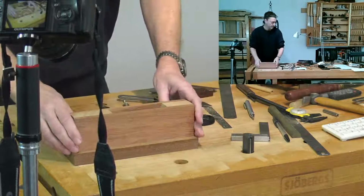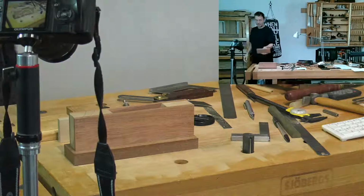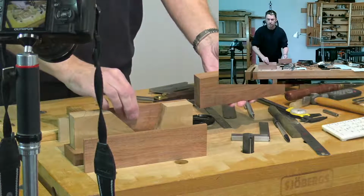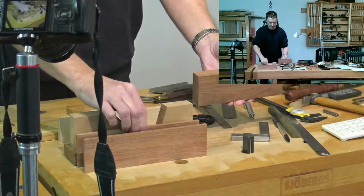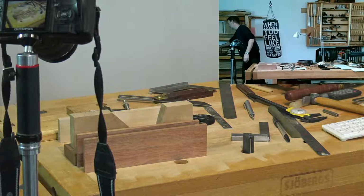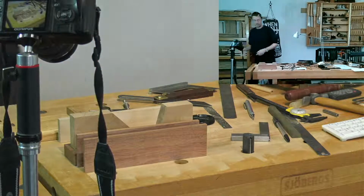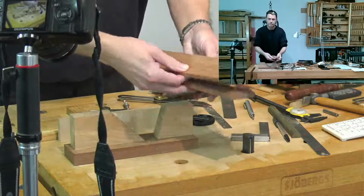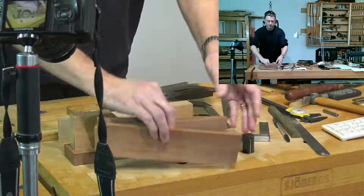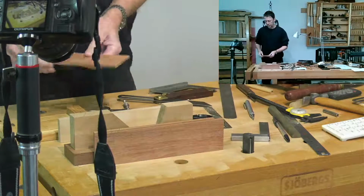So last time you would have seen I had a piece of marble wood, very similar to this. Well, actually that was the end of it. And I cut a section long enough to do the sides of the plane with. And I ripped it. I think I may have shown you the rip. If I didn't, I'll be able to show you that in the rushes next time. So I ripped that actually into 3 pieces. So we have those 3 pieces like so. Took the middle one out, flattened them because they did in fact move quite a bit. So we've got two flat sides.